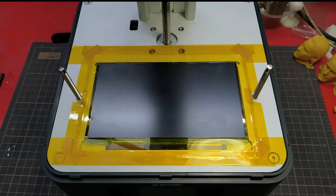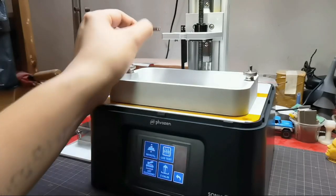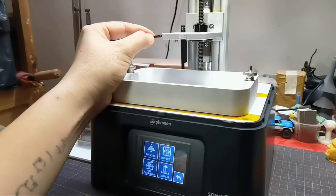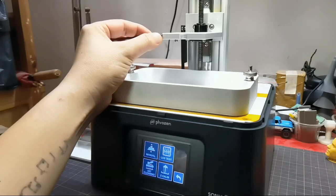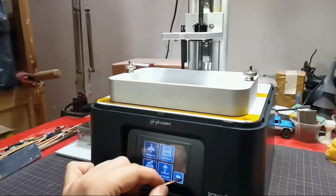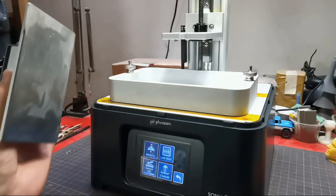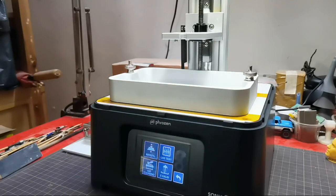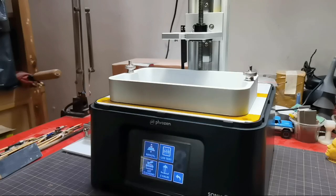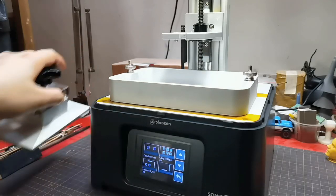Feel free to apply a screen guard or not — it's up to you, it's your machine. But I prefer to protect the screen and even the motherboard inside in case of a leaking resin tank. It's also faster to clean your screen — if you have a leaking resin tank, just remove the screen guard, apply a new one, and you're done. Now let's talk about leveling. I noticed during the first several early layers the arm is bending upward, meaning the zero height during printing is actually lower than the zero height on Z-axis calibration, which means your build plate is pressing down harder onto your screen and film, and could shorten their lifespan.